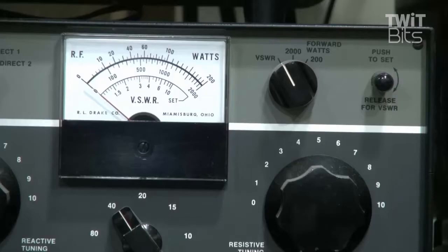The alternative to an antenna analyzer is an SWR bridge or meter, or the SWR meter in your radio, although these require you to transmit. The antenna analyzer is nice because it's off air. It also makes it easy to take out in the field versus taking your radio out. So we'll look at an SWR meter first, and then we'll show you doing the same measurements with the MFJ analyzer.